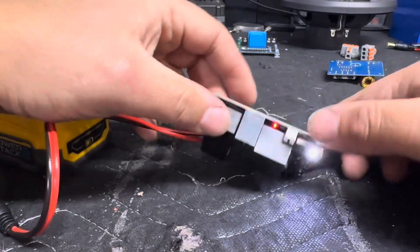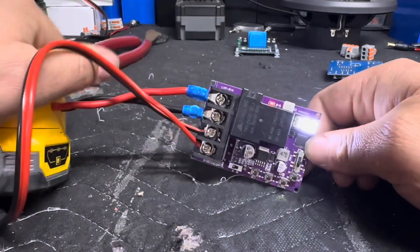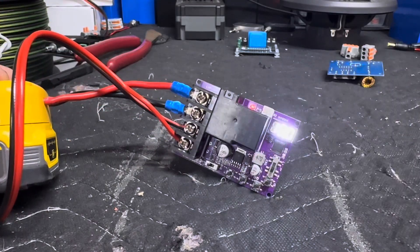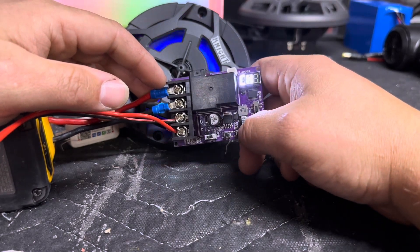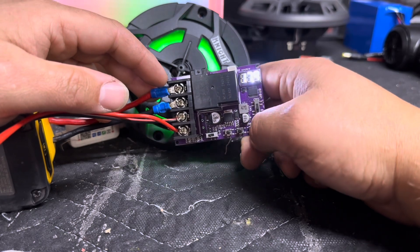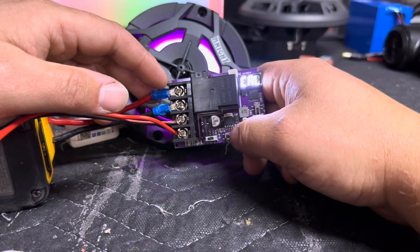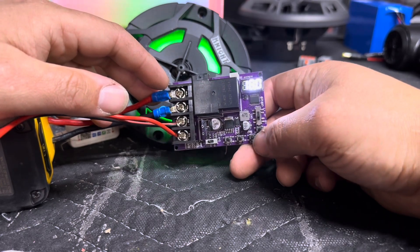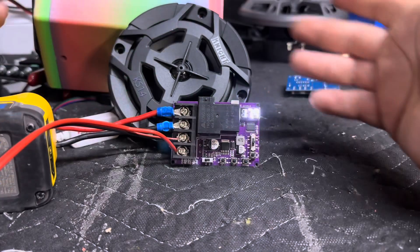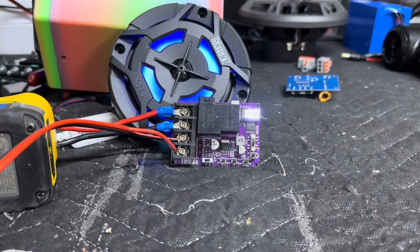On the threshold, for the time delay we're not going to set that, so we're just going to be at zero. We're at 18 volts. Instead of doing a time lapse, we'll set it again to show the process. We're going to change CH — set that to 18. Come back to CL and set that to 17.9. Now it will die a little bit faster for us. As soon as it hits 17.9, those lights will cut off.